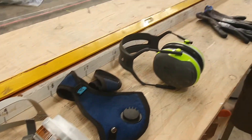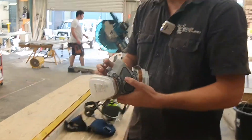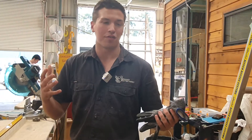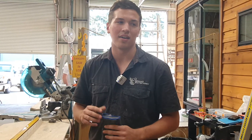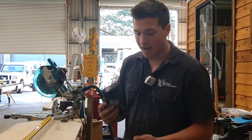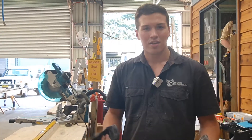We have a pair of gloves, safety glasses, earmuffs, a light dust mask, and a full face respirator. So why would you wear gloves? In carpentry we use a lot of treated timber — that is timber that has chemicals all over it. A lot of these chemicals are cancer-causing, like arsenic and similar substances, so you don't want that on your hands all the time. Definitely go to Bunnings, $10, good pair of gloves. If you're working with this timber, glove up.